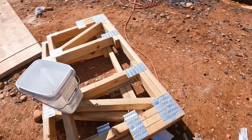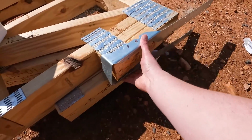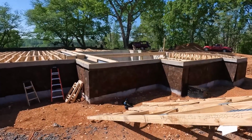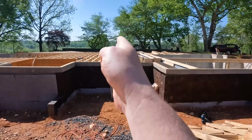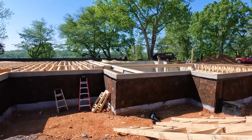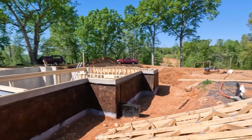See how this is notched out like this? That's so the hanger could go on it like this. Then the top bends over the top of the steel on the other side, and then it's nailed. So they hang on those. They have to be offset, kind of like these floorboards are, because they can't run straight into each other, because the hangers would interfere with each other. So they have to be offset, the hangers side by side, and they'll hang all the way across on both sides. But they got the steel in there, so I'm gonna walk down there and check it out.